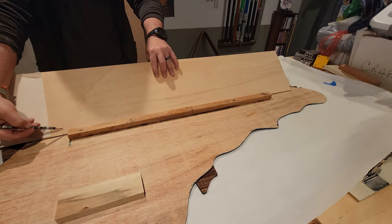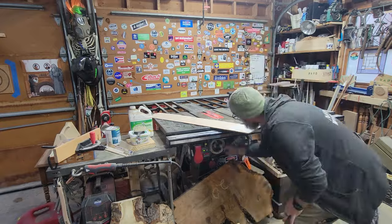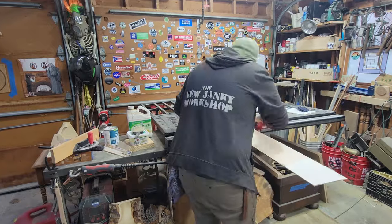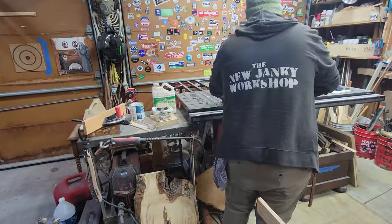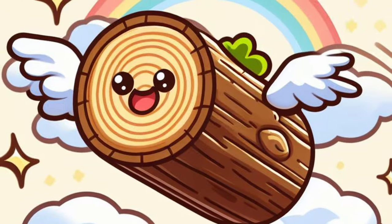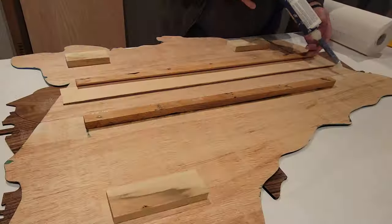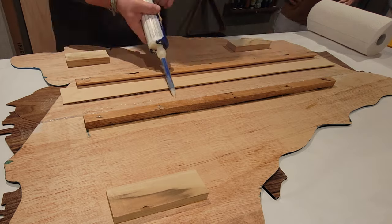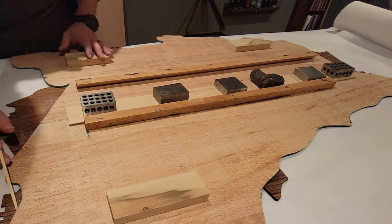Because we had two different seams, even though they were offset from each other, we're adding just another piece of wood to help strengthen that joint between them and keep it solid — just cutting out another piece of eighth-inch plywood. And we're using Thixo epoxy to put that on there. While doing this, we're also getting around the edges between the front of the map and the back of the map just for more adhesion.